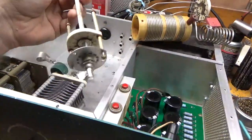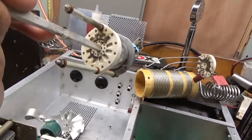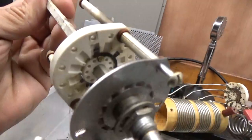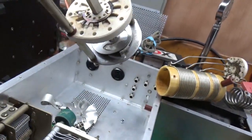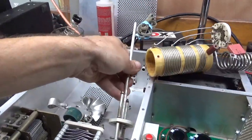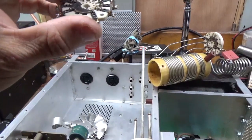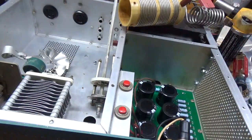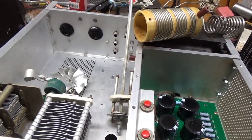I have it removed and took apart the switch — cut the shaft like I said. I drilled the rivets out for the bad contacts. The wiper portion is perfectly fine on both sides. People look at them, see they're black, and think they've been burnt up — but that's actually tarnish, because the material is silver plated. I have a donor switch out of another amplifier with perfect contacts, also tarnished. I'll drill these rivets out, put a screw through with a nut — little tiny screws — and put solder over the nut to keep it from possibly flashing from a sharp edge.